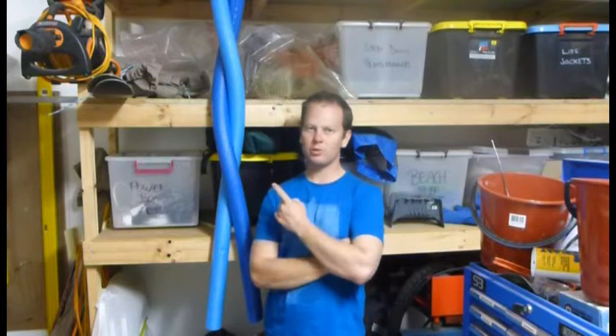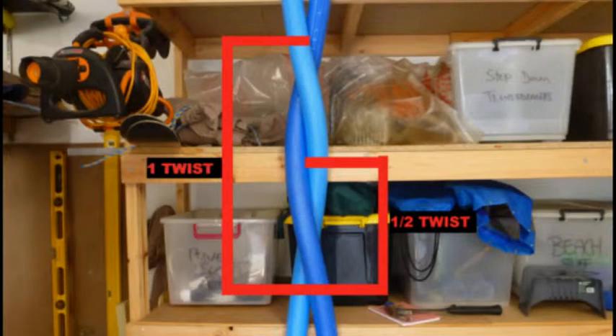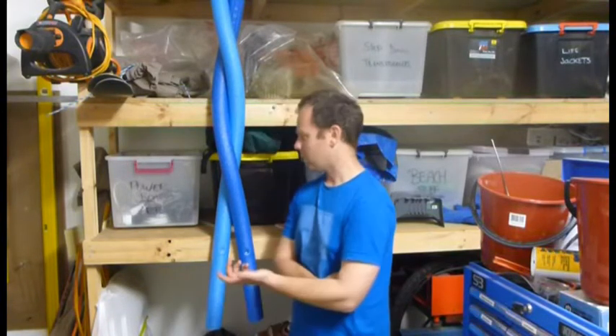I'm going to show you how to terminate a CAT6 cable — just a few important things you need to remember. We've got a couple of pool noodles nailed up here on the wall simulating the twist in a pair — a full twist of the cable. Each wire takes its turn being closer to the source of electromagnetic interference, whether it be a field created by another pair in the cable or an outside source of radiation. The twisting basically means the cable is balanced, so whatever interference is induced in one wire is induced in the other — they cancel each other out.